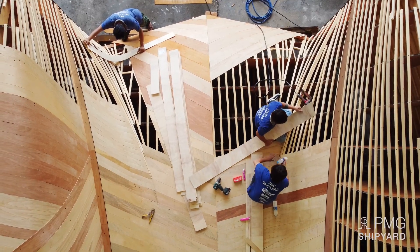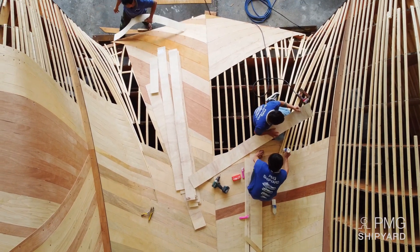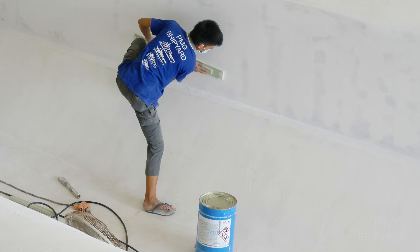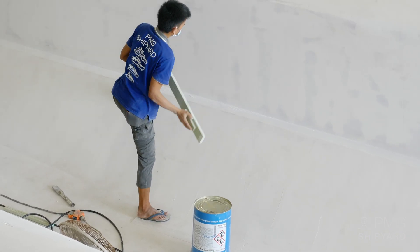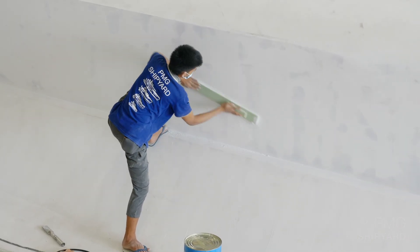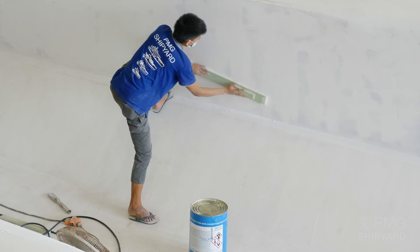The life of a boat starts with a plug. Before manufacturing the plug, we manufacture a jig, which is made of marine plywood that we put together. We then cover this marine plywood frame with a kind of powder and hardener to make it like baby talc. We apply and wet-polish this powder, which becomes very hard — almost like fiberglass, but it is not. From that base we start to paint and do our molding.